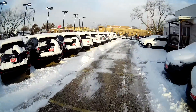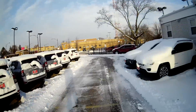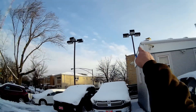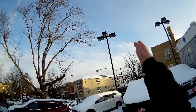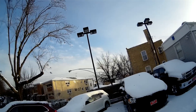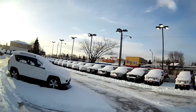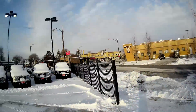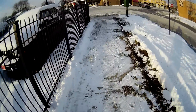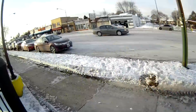There are a lot of lights out here — we haven't done any maintenance on this lot since early summer when we did this lot. Most of these outages are going to be inline fuses because the chances of all three lights, all three ballasts, or a combination being out at once is very unlikely. I'm going to go ahead and replace the rest of these inline fuses, and then it's bucket time — freezing your butt off up there. That's what we've got going on here, guys — comment, rate, and subscribe if you want to.